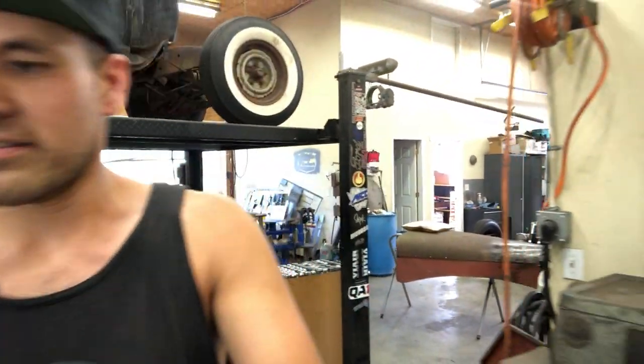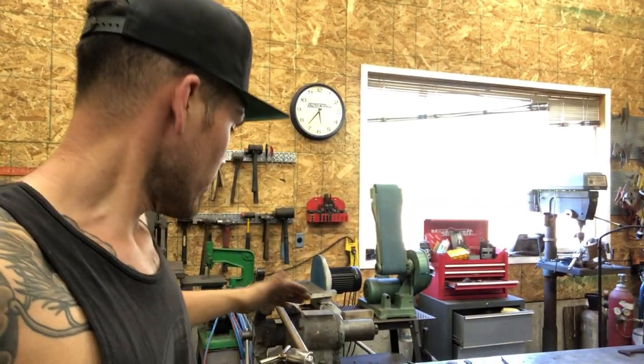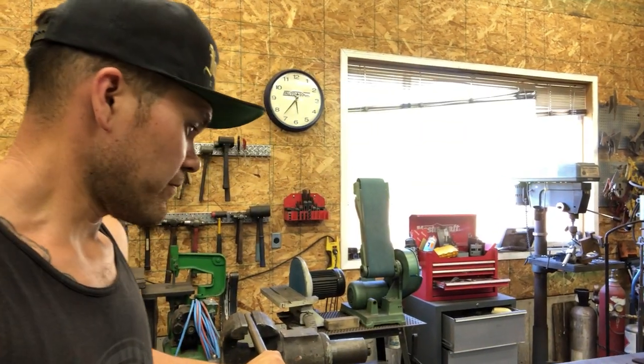You need to have a little bit of play in there for something to be able to easily slip up and down. You don't want to be forcing it. So I'm kind of at a dilemma here. What do I do? Do I have this DOM piece of tube put onto a lathe and have somebody machine out like 3/16 or 5/16 or 10/16 or whatever I decide? I'd rather not. Number one, it's gonna cost more money. Number two, is it super necessary? Can we figure something out?